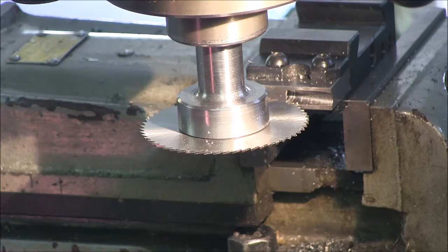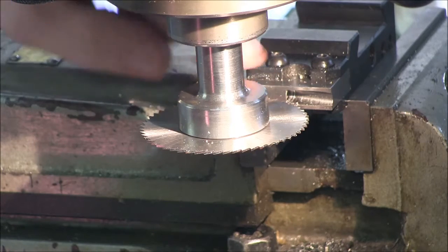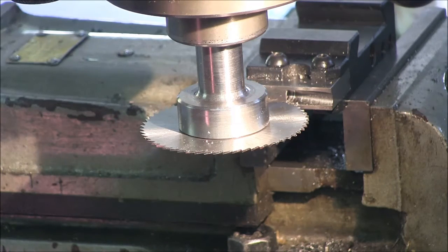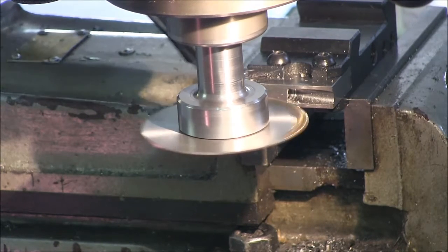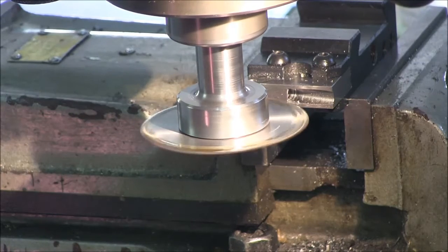All right, I drilled the hole, but the bit wasn't as tight as I'd like it to be. It wasn't a press fit. So what I'm going to do is, I drilled a hole, you can't see it because it's behind the saw, but it's threaded for a 10-32 for a pinch bolt, and now I'm going to slot this thing so that when I crank down on that pinch bolt it grabs the bit. So got the mill set for 100 RPM and we're just going to cut right through this, hopefully. Actually, that kind of looks a little fast to me, so cut 50.